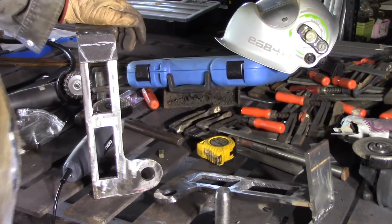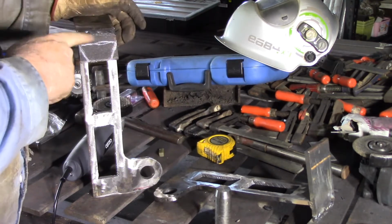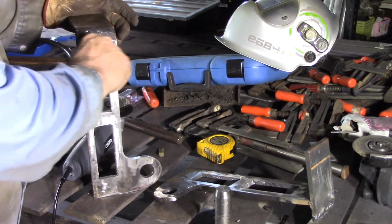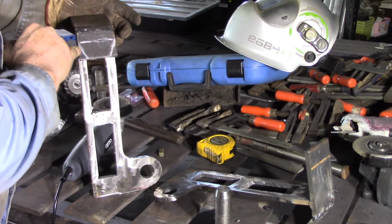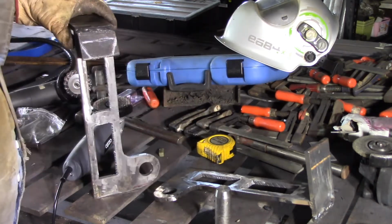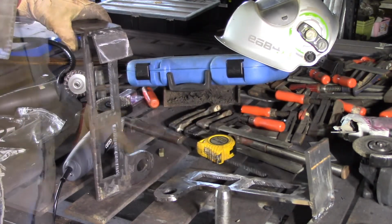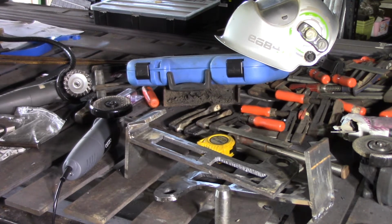I'll put it on the tractor, mark where the crease in the sides of the quick attach on the tractor end goes, across this line here. It was mainly there so I could get the points where I wanted to chamfer these corners in, so that helps guide it into the right spot as you come along to put the bucket on. It's a good idea, I think, but it remains to be seen how well it'll work in practice, which is why I don't want to put plans up until I've actually finished and tried things, and then I can tell you what works and what doesn't.